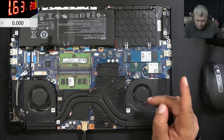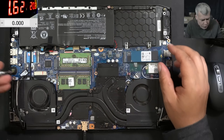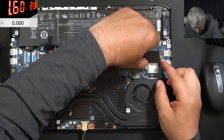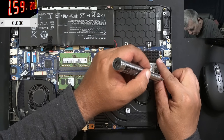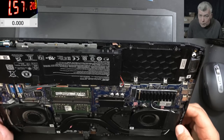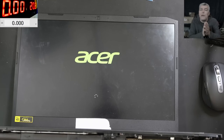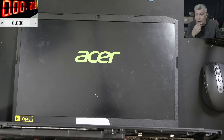All good, apart from the SSD. I'll unplug the SSD. People get scared about unplugging and plugging the SSD, but here there is no voltage when the laptop is off. I'm going to plug another SSD. Let's see if it's booting and working. Now pressing the power button — the charger got disconnected, but I can see the power supply is good. It's loading Windows! I can't believe it. So the customer actually wiped the hard drive, or the hard drive is faulty.